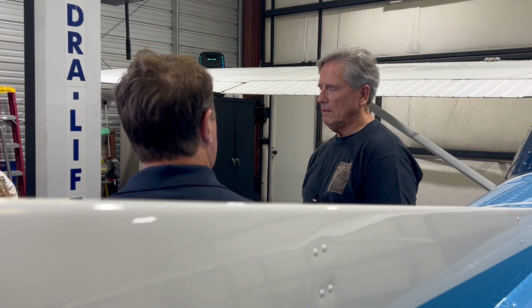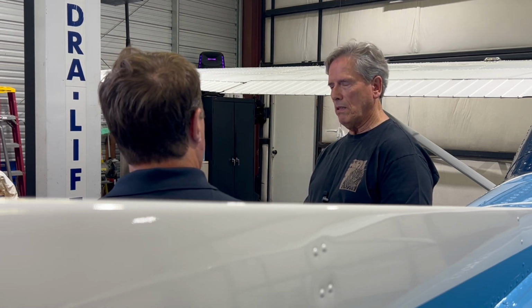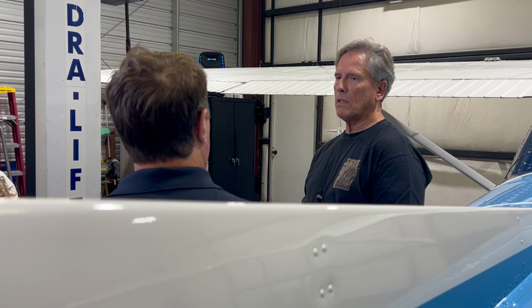Yeah, well, we all deal with those kind of things in the aviation world. So looking at your IFR rating, did that have any sort of impact on the instrumentation that you were going to put in the plane? Absolutely. My desire was accuracy and reliability. So I had to have some redundancy. I had to have instruments that I could understand quickly because I'm scanning the whole time. Right. And if you fixate on one instrument, you know what the result of that is. So you're looking at different instruments, and being in the green is important. Sometimes you need to actually know the numerical value, the quantitative value. So I do that as well, especially regarding heading and altitude.